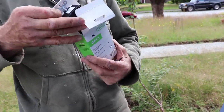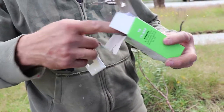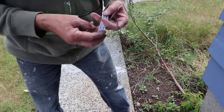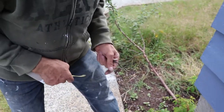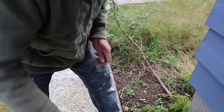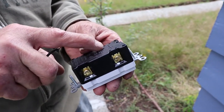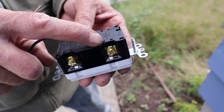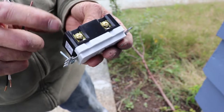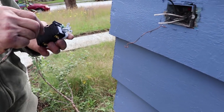I was expecting something different in here, but this is what we have and it's what we're gonna work with. Here we have the part itself, the cover, the sticker - I'm just gonna throw that in the bucket - and a couple little screws. You can see it indicates 'line' - this is where the wire is coming in - and this is the 'load' in case you want to put more protected wire. In this case I don't know where this wire is going, so I'm just gonna do the regular line.